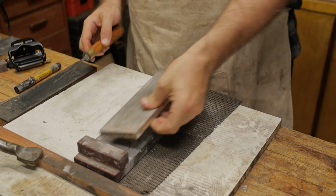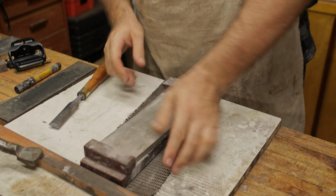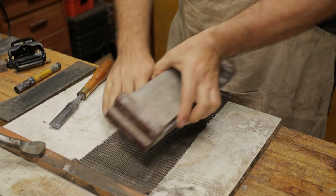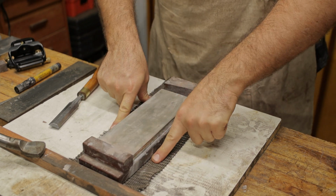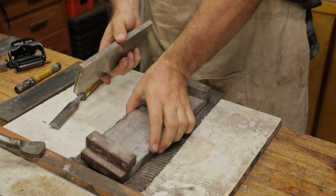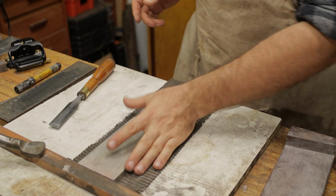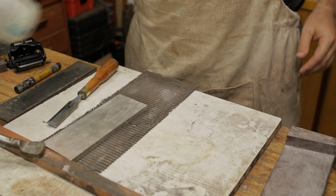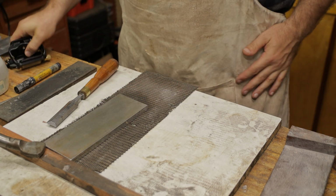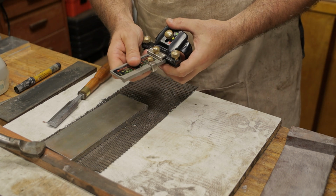So I've got my 400 grit here. I've just got a little piece of timber here set up to hold it, just held with the hold fast so it doesn't move around too much. And just a bit of non-slip here to hold it, and this homemade holder jig which I use for the water stones, but right now I'm going to go ahead without that because it's not needed. I like to use a little bit of water to lubricate my stones, even the diamond stones, and we use the honing guide. So I'll go ahead and we'll put the fence on the honing guide.